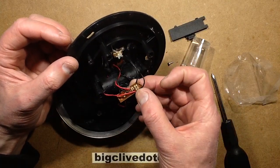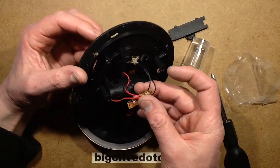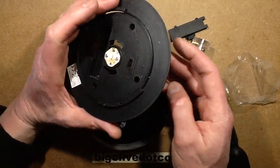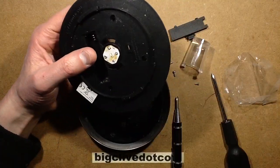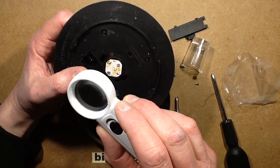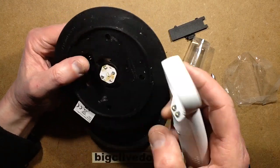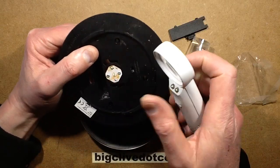I'm guessing these two resistors here are possibly relevant. It doesn't need a boost circuit because it's got the 3.2 volt cell, which puts out more or less the voltage required for the LED. I wonder if the LED is working — there's a wee mark in the LED, but it's not in a sort of burnt-out type of way.